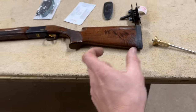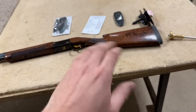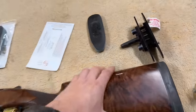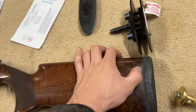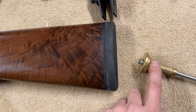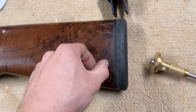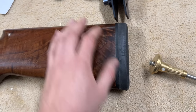And I use packers and pieces of timber to basically set the gun so it sits right and sits back against the fence and run the saw blade down on them score marks. And it's been successful. With a nice sharp blade and the score mark on the underside, I get a really clean cut around the gun stock at whatever length you need to cut it down by.